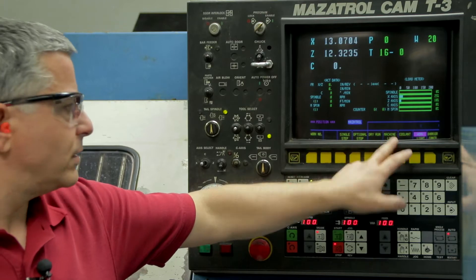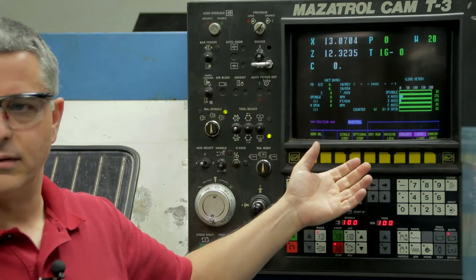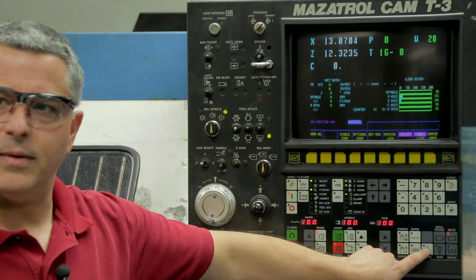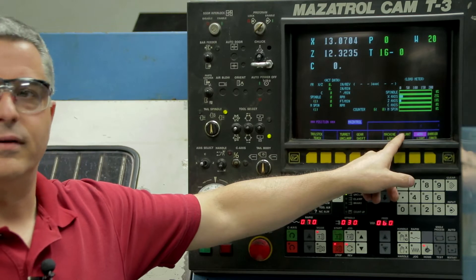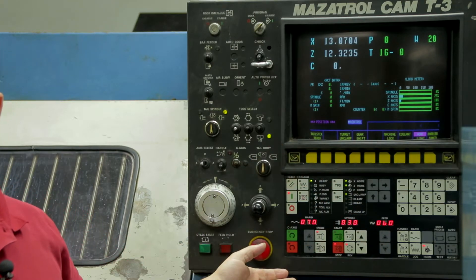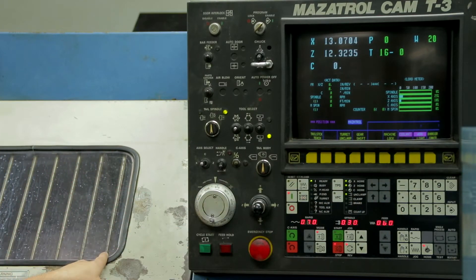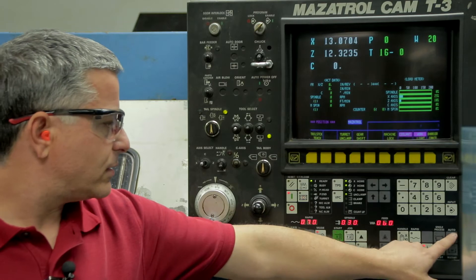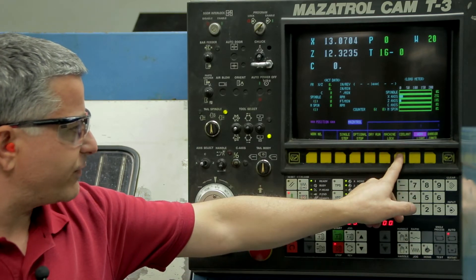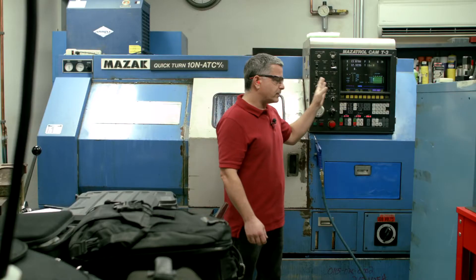This is the coolant when the machine is in auto mode — if I push it, that's how the machine is going to run the coolant. Now when I go back to manual, take note of the coolant button: if I go back to manual it shuts off. So these four areas are different from the manual side to the automatic side. If I turn on the coolant in the manual side and then go to auto, the coolant appears to shut off — but once you go back to manual, even if you turned it off in auto, the coolant comes back on because it's a separate switch. Important thing to learn so you don't get wet.